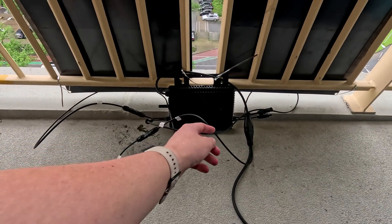So I changed them for some new ones and I bought eight new 100 watt solar panels. I've got the Hoymiles double and four inverter for 800 watt — it works really good — but I'm switching it to the EcoFlow PowerStream because in the future I want to connect the inverter to a battery. When the sun is shining you can charge the battery, and then use the battery in the evening to power all your household things.